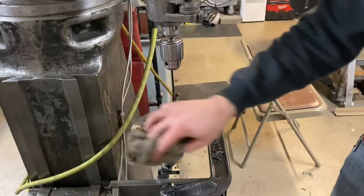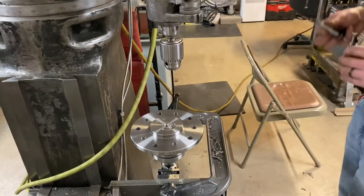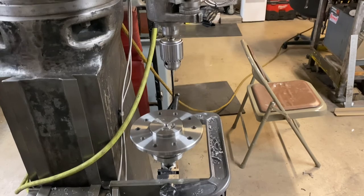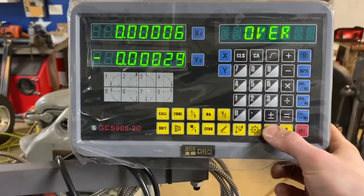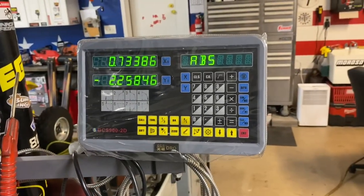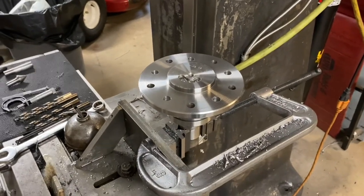Double-checking this last hole for our final dimension - 0.457, perfect. That's it for this one. On the digital readout, one more arrow down will tell you you're done, or it'll loop back to the first position. Just hit the bolt circle button to bring it back to regular absolute mode on the DRO. That's my setup on how I drilled the incorrectly-ordered axle flanges - thanks for watching.